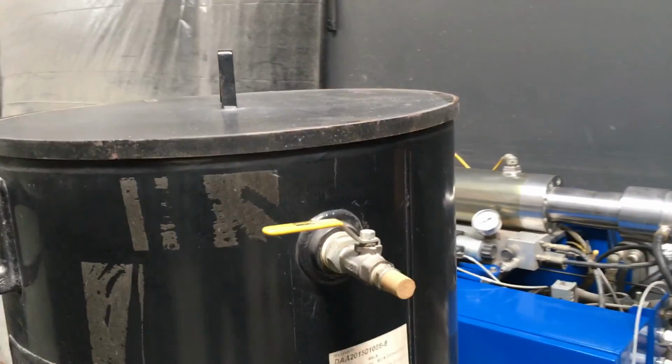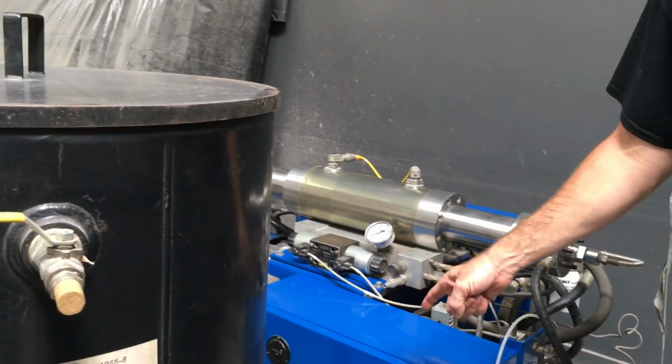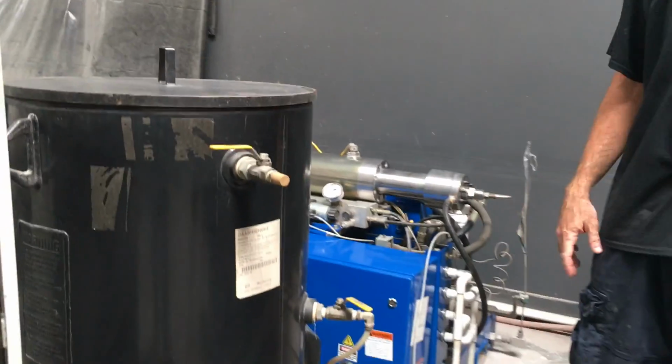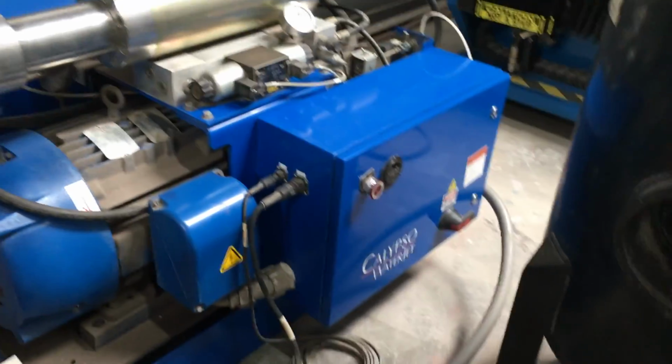Yeah. So KMT would be able to tell you. I'm 99% sure I know it has to be 3-phase. There's the big 460 hookup, there's a 230 hookup, and there's another one in there as well. And it's just from changing some wires right where they're intended to change. Now, does that go into that panel? The power? Oh, I see what you're saying. Yeah. So here I've got my, oh no, it's got the 460. It's got the 460. Oh, I was way high there. There it is.